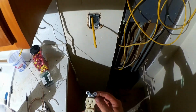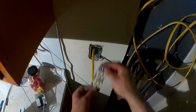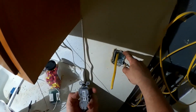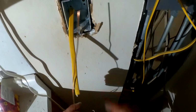In the old days, it was considered good enough that a metal box would become grounded through the frame of the device here, because that's grounded. But that only works when it's screwed in, and that only works when there's good contact. And we're talking about contact between steel here that often gets painted and is galvanized. So, the modern practice is to give the box its own ground conductor that will be wire nutted in with the rest of whatever ground is going on in there,